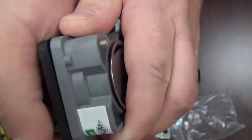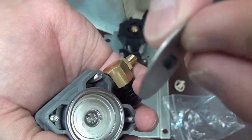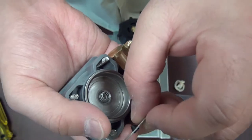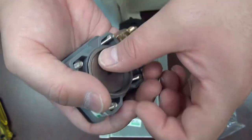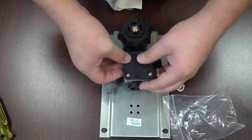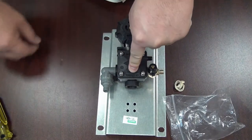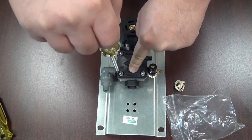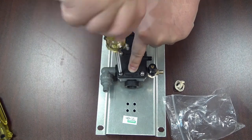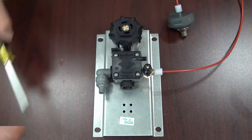Flip it over — underneath you'll find the pilot orifice plate, just like a non-metering servo motor: the flat piece, cone, and a spring. To put it together, make sure the cone on the pilot orifice plate is facing up towards the spring. Then place this on the valve with the timing adjuster facing away from the elbow so you have room to adjust it. Tighten these four screws.